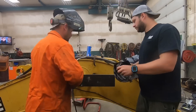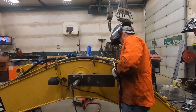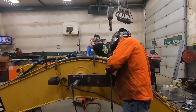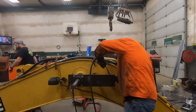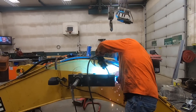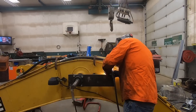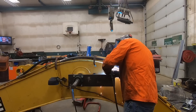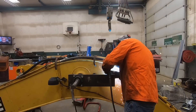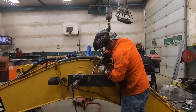The most important thing is that these bearings are mounted very rigidly to the boom and won't lose their position when we take the bore bar in and out a few times. As we're cutting, there's a tremendous amount of side load on the bar from the cutting tool. It actually shakes the boom quite a bit. One of the things we learned is we were going too fast with the cutting tool — we basically followed the instructions of the owner of this machine. He wasn't able to be present but gave Aaron and Mike a crash course. We found some things we disagree with; we're not sure if he was wrong or if we just misunderstood him.